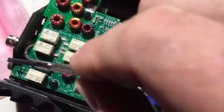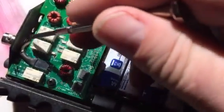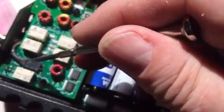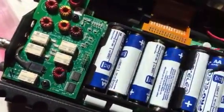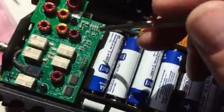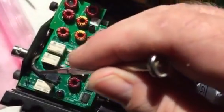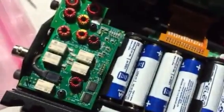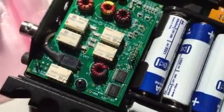That comes up — that's normally plugged into the bottom board, just disconnect that, lift it over. I'd recommend that you sort of push that in part way, and then obviously line the board up. There are pins here that have to line up, and there are some pins there that have to line up. Push the board down, tighten your screws, make sure that's connected — it doesn't matter which way round. Both of those are to the centre pin of the BNC socket, so you can insert that any way, whichever way round you like.